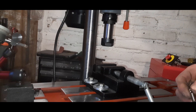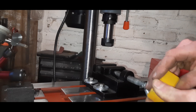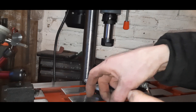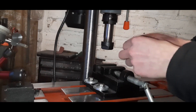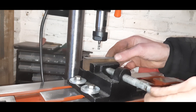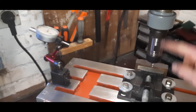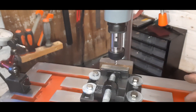I will put in this five millimeter end mill with a six millimeter shank. I have to say these are very cheap from China, but the quality is really outstanding. Now I have to set the depth with the quill lock — that isn't ideal of course, it needs to change in the future, but again for testing it doesn't matter.